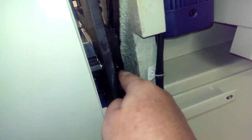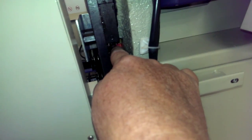In this video, we're going to talk about replacing this part on the lever that pulls down your blade. Every once in a while, you'll get a part like this. If it breaks right here, you might not be able to see that part in the video, but you'll see it once we get it off. That will break, and I kind of simulate it. I just disconnected it from this little pin right here. But usually the other part will be broken off on this pin, and so you'll have two parts. But we're going to show how to replace it with that pin.